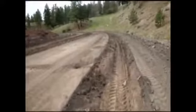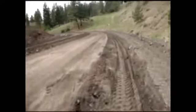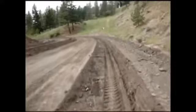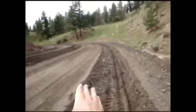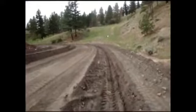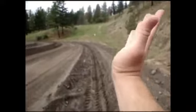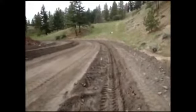And yeah, so I guess I will probably set my cameras up at some point and show you how I've been doing this, but it's an interesting process. I've never seen this done before, as I generally don't work around road graders. You do your ditching pass here, and then you leave your tire running along the bottom of it, because there's a little bit of spill off the end of the blade, and then you tilt your blade way out the side, so it's almost about a 45-degree angle, and you do a sloping pass to cut your back slope.